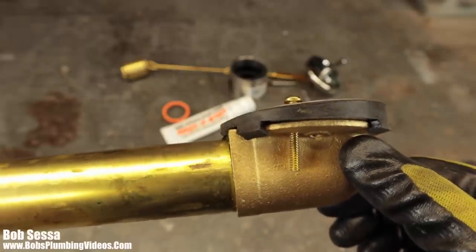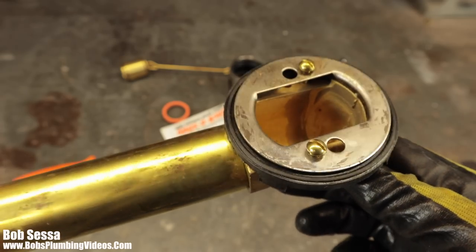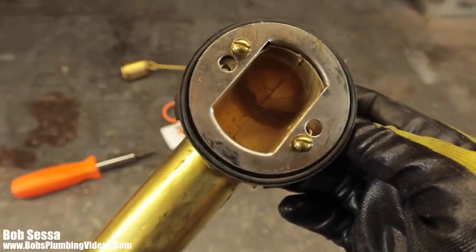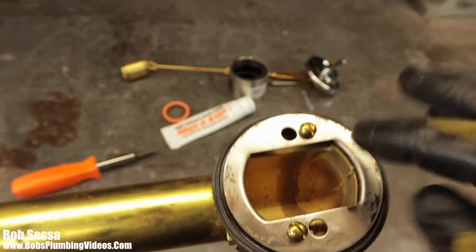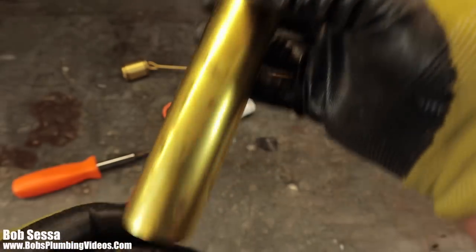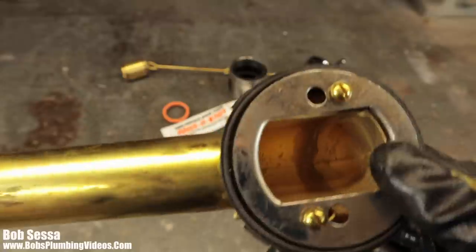And that's very, very important, especially in a case where you have to have somebody come in to snake out the bathtub because you have a stoppage and they have to introduce a snake into it, because all the snaking has to be done through the overflow. It would go straight down the overflow, past the T into the trap and onto the drainage system.